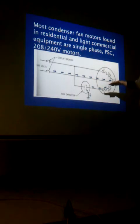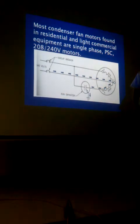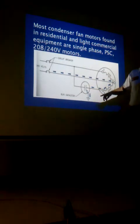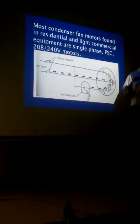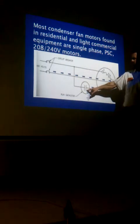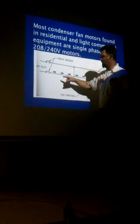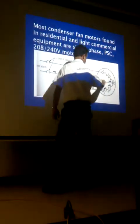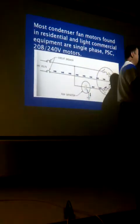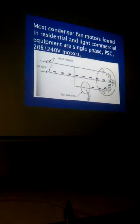This drawing was really emphasizing identified terminals and run capacitors. If I had the identified terminal on the start side of the run capacitor, as long as it doesn't fail, it's going to work. But if the outer plate swells and touches the case, it goes to ground. Notice that overload current going to ground — the start winding runs right to ground — so it would be getting 120 volts all the time, and I would burn up my start winding.